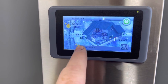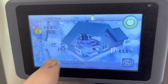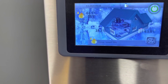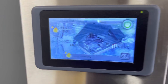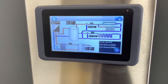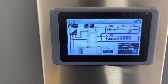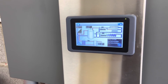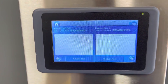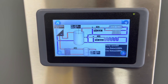The display tells you all your readings — inside it's 23.2°C, outside it's 18.3°C, and hot water is showing 63–65 degrees. You can go into the menu and it shows temperatures at different sensors so you can work out your delta T and set everything up. It's set to 25 on weather compensation. The heating part is actually turned off right now, but there's a lot of information in here including charts — really good.